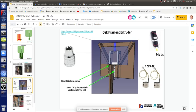Like, what's the real block? Now, in a Precious Plastic system, they do have, as I mentioned, that set screw at the tip, which allows you to control how much you're actually blocking the orifice. So as far as how much will escape out the nozzle, we can rig up something like that. That means screwing in another intermediate element where we tap out a hole and put a 1/4-inch bolt in there or something like that, where we control the amount of stuff that can come out right before the nozzle. So with a bolt, if you screw it in, you're literally closing off that hole at the end. So there are different things we can play with.